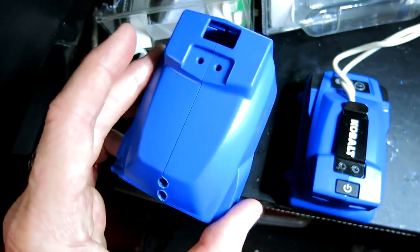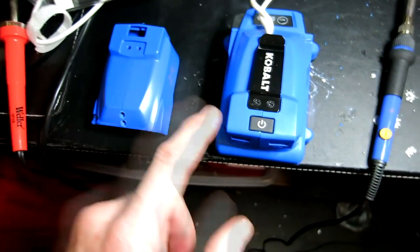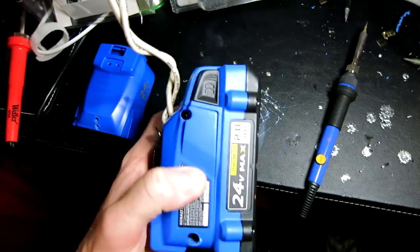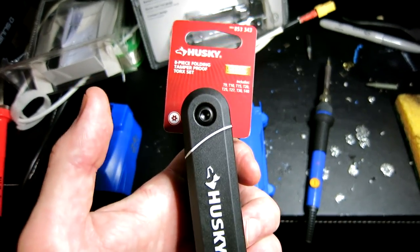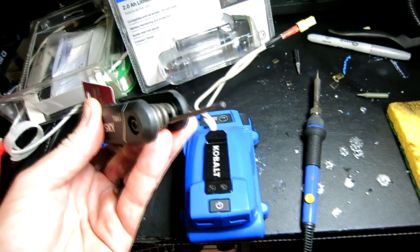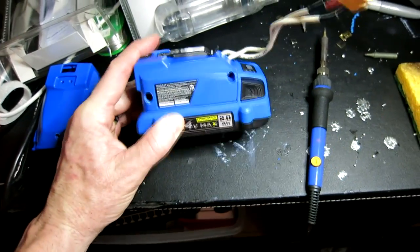Here is my power source that I drilled into. I took apart the power source — there are two Phillips screws that remove the clip, and then two holes expose a security tamper-proof Torx. The precise sizing is TT10 — it is a tamper-proof security Torx with a little indention right in the middle, which makes it different from regular Torx. Here is our end result — we have 10 gauge wire coming out of it, red and black, positive and negative, with an XT60 connector.